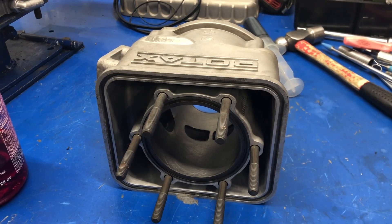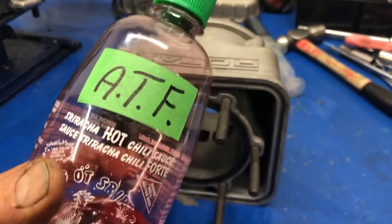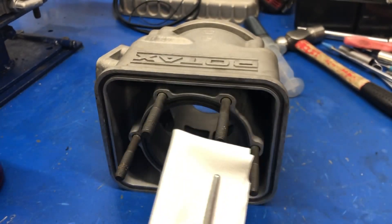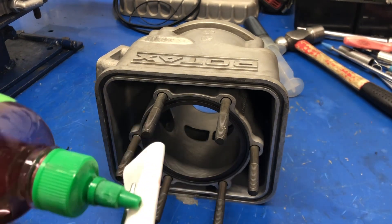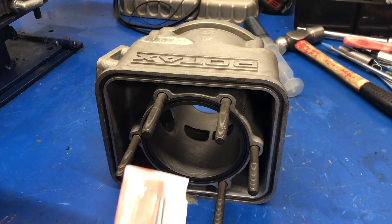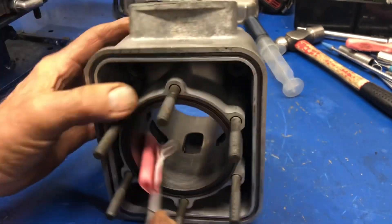So now I've cleaned them the way everybody is used to. One more step that cleans them even better. I have a recycled bottle with automatic transmission fluid in it, and this little wiper clipped in here is a lint-free wiper — you need to use something with no lint. If you're using a cotton rag or something, you're going to put more lint in than you take dirt out and you'll just have gritty lint in there. So I soaked it up and I'm going to apply it — we want to oil these anyway so they don't get any rust on them.